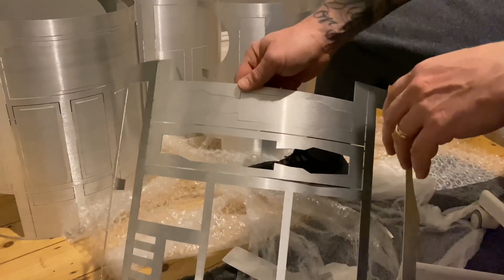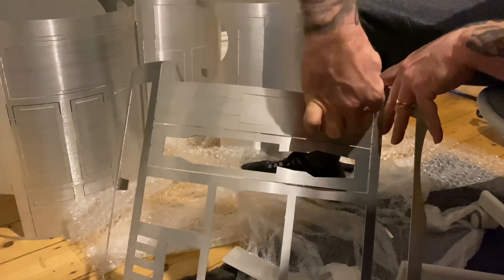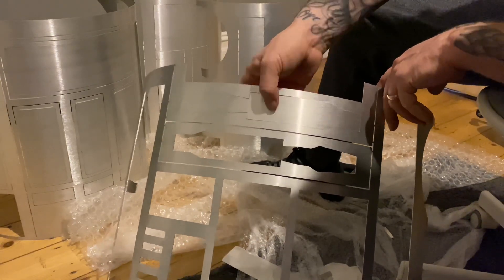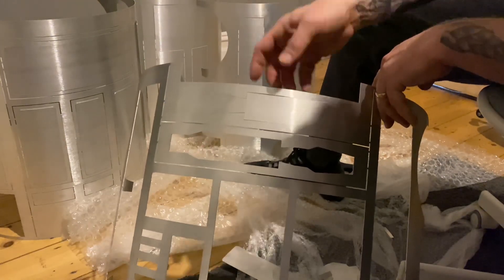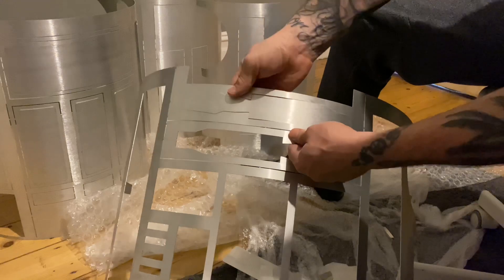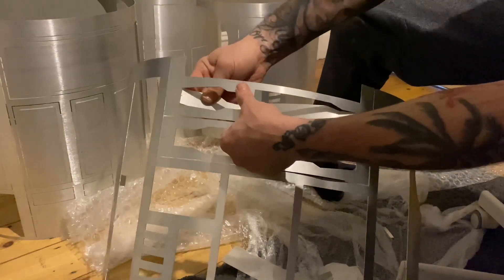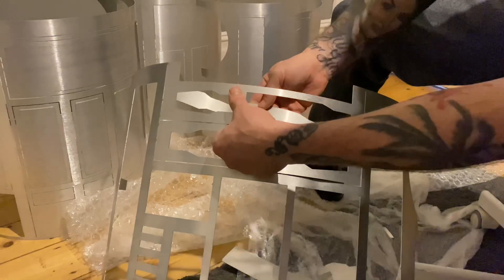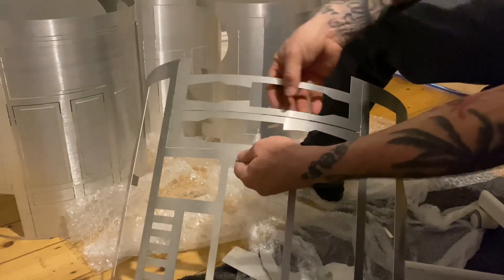It's better to show you this part. When you're taking these arms out, this whole area comes off — you cut right along there and this whole section comes out. These are two separate pieces. It's much better to take these arms out because this material is very soft, very pliable, and easy to dent and kink, which would ruin your skins. Support the skin you're using and push through carefully. Wiggle it side to side until one of the ends gives, and then it comes off — otherwise these could easily get bent.